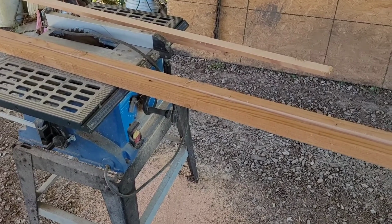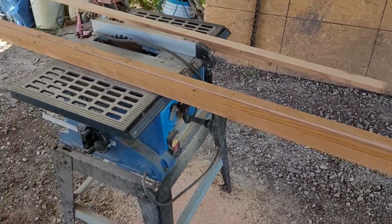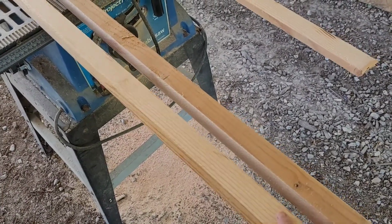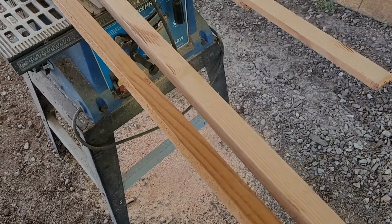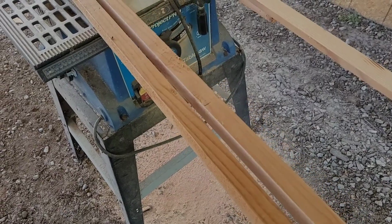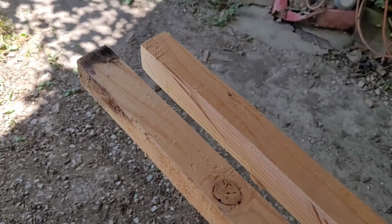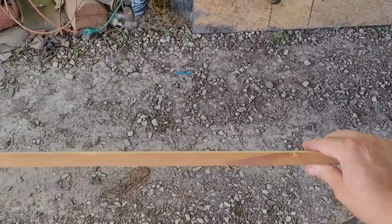All right, so I actually just went ahead and did the process of ripping my 2x4 that I started out with. So I just ripped it down the middle. I did that because I just used the natural edges that the board came with to keep straight. That way if I wobbled any on this inside cut, it didn't transfer over on my second pole. So I used the outside cut on it. Also, I figured it would be a little bit straighter than what I cut, which, I mean, I can show you the proof of that down here. You know, I got off a little bit, so I'll probably put that up at the end where I'm not attaching the head. I'll probably put the gig at the other end. And then I just ripped out the center.